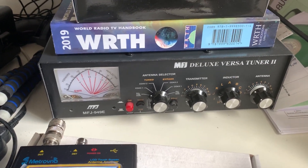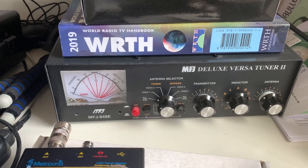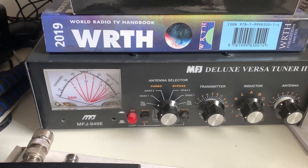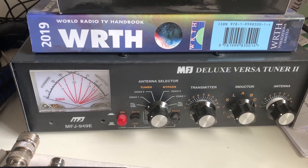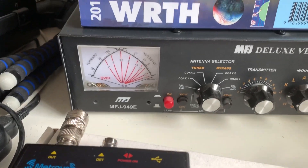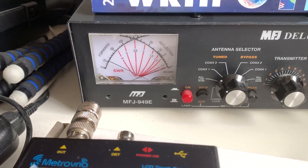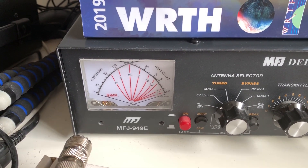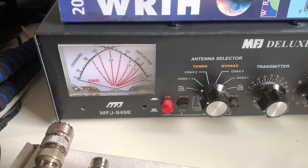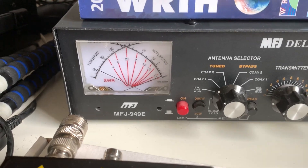It's interesting that now the antenna is repaired, on the 17-meter band you can tune it on the MFJ such that the reflected power needle literally doesn't move when you transmit. I can't achieve that anymore on 20 or 40 meters — something electrically has changed. But it's not really an issue because when I transmit it's still matched very well, moving only slightly, better than 1 to 1.1. Good enough — I just thought you'd find that interesting.